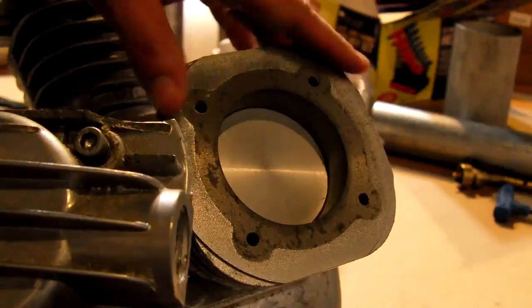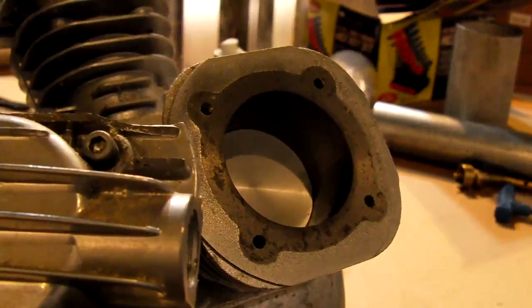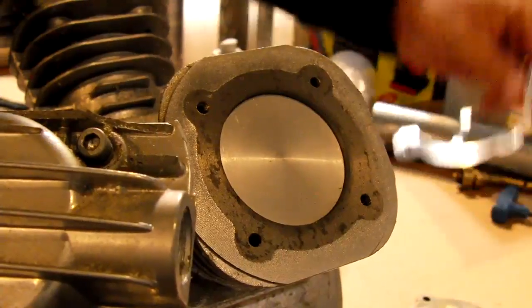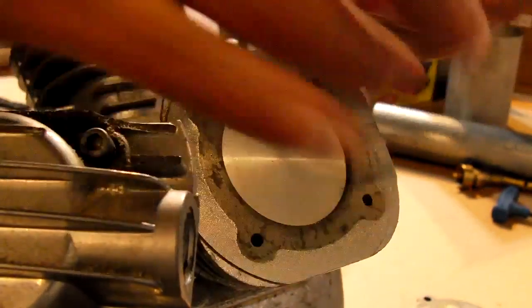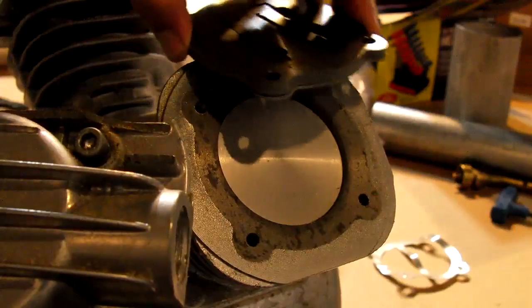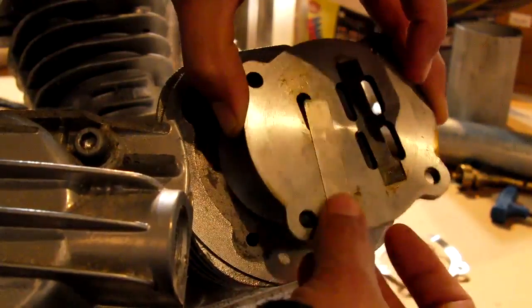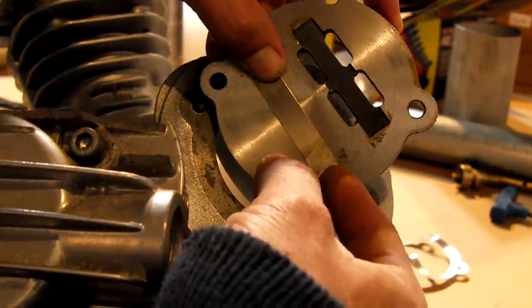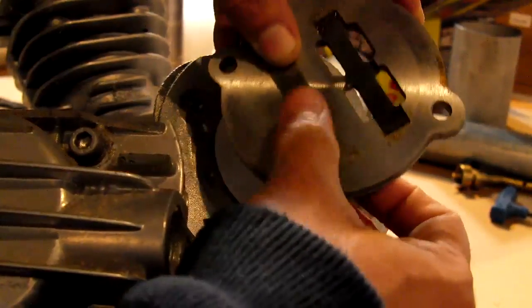What I've done is I've removed the cover for one of the pistons of the compressor, and here's the gasket. You want to try not to damage these — if you ever want to turn this back into a compressor you're going to have a hard time doing it if you damage things. These are the flap valves. Basically this is all that they do: they sit in place and they flap open and closed, and this is what allows the pressure to go in one direction.